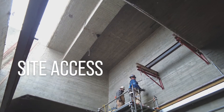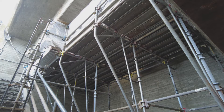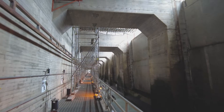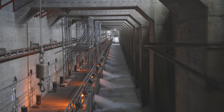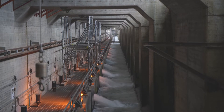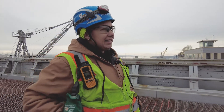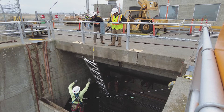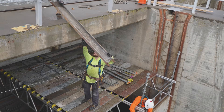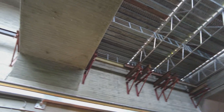We're using two different kinds of scaffolding systems. One is system scaffold, pretty standard, coming up from the fish access walkway underneath our beams and then going straight up to right below our beams. The other one is this Haki system, which is anchored directly into the pier walls and the back pier wall — it basically looks like a floating scaffold just sitting on these anchor points.